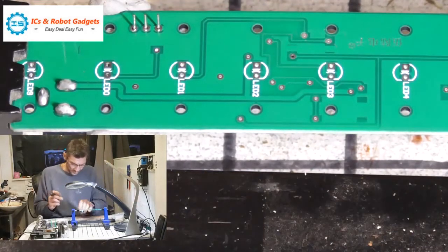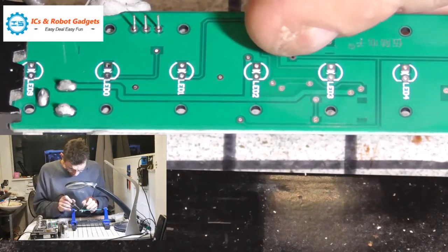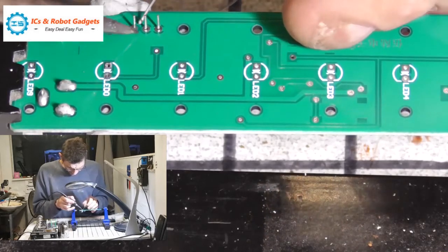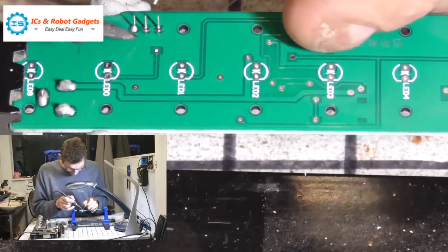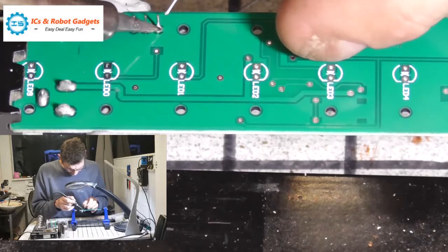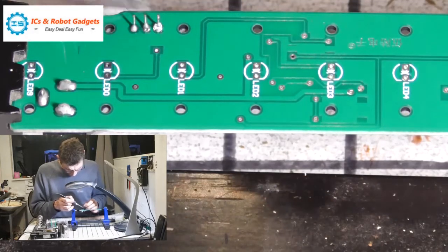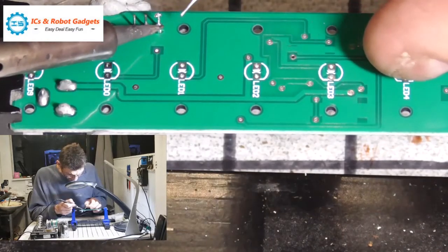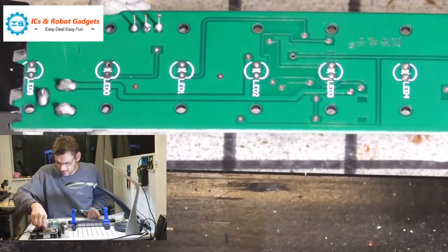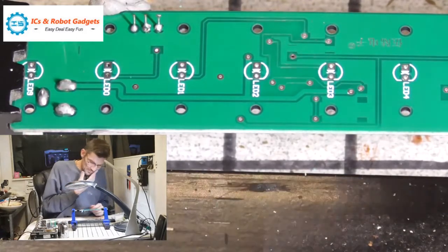Extraction fan doesn't really do as good a job as it used to when it was outside and in front of Mr. But we'll have to come up with another extraction plan. So this will be the electret mic. This will be the resistor jobby. This solder is pretty crap. I've got good solder and crap solder, and this is the crap one. There we go. I reckon there must be a lack of flux or something in it. Bring that back down to 360, 355 even. But yeah, I really don't rate this one. They're both off Amazon, just one's crap and one isn't.